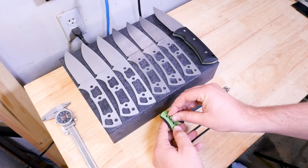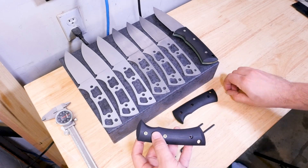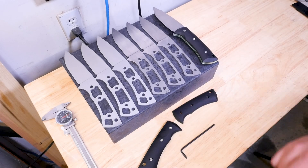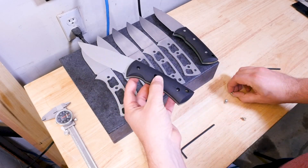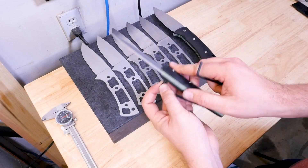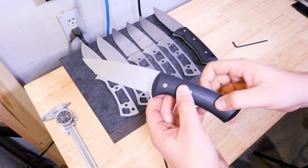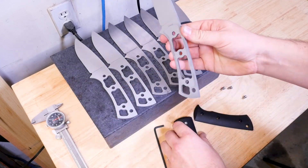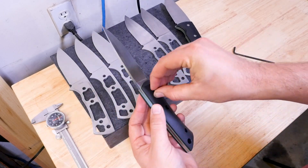Right off the machine the texture and grain of the G10 are hidden in a chalky finish, but a little bit of WD-40 and a quick buff brings out all the detail of the grain and the color — and I think the black's my favorite. Now we've got some blade blanks and handle scales. These have been roughly hand finished in preparation for heat treatment so they're not perfect yet, but this is a good time to check the fit. This is where if you've made a mistake somewhere in the process it's going to show up. I aim for a fit between the perimeter of the handle scale and the knife tang of about 2-3 thousandths of an inch, which is around the thickness of a human hair. I found that if all the dowel fits are tight and I use the same work coordinate offset to machine the fixtures as I do to machine the work pieces, and the machine is warmed up before starting the job, the accuracy possible on these little mills always surprises me.